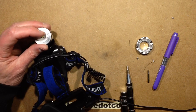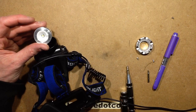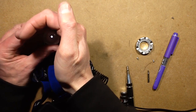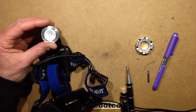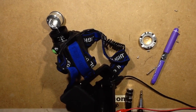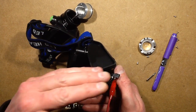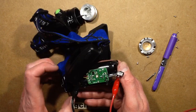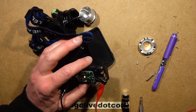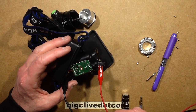The LED cuts off at around 2.5 volts but the circuitry itself is still drawing current — the red LED is part of the reason it continues to draw down to about 2 volts before cutting off. So if you left this on continually with non-protected cells, it would really drain them down. The red LED is kind of pointless and has a slight downside in that respect.